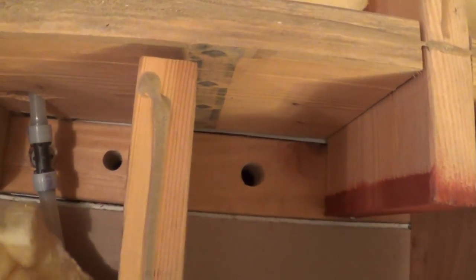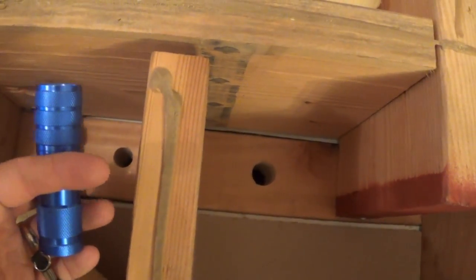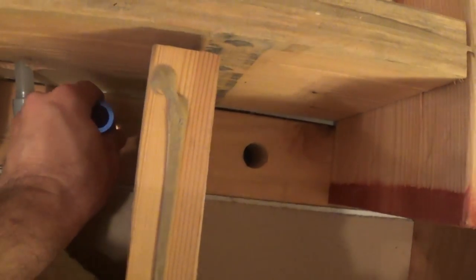I'll have to drill holes in the crawl space too, but I just wanted to verify where we're going. I drilled two holes — one one-inch and one just larger than three-fourths of an inch. I have this little flashlight — not sure if you'll be able to see this — but I'm going to stick it in the hole. You can already see the light coming through there. If it focuses we'll be in business — there we go. You can see we're all the way down to the bottom of the wall. That little line in the middle is actually an electric conduit coming through, and moving this way you can actually see the water line coming through. Everything seems to be exactly the way the picture showed, with a clear path.